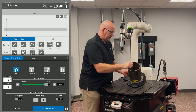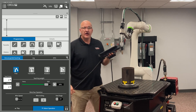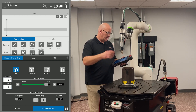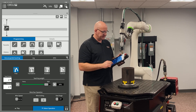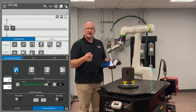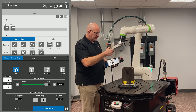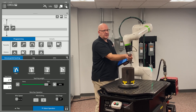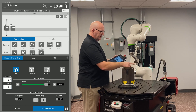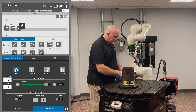I'm going to position the part with the weld start pointed toward the robot — the six o'clock position. I've created a program called 'circle,' and I have my robot operation tab up in free manual guide teaching mode. Before moving, I'll record a G point for home, then pull the dead man and force it out to put in an intermediate point so I don't hit the part. Now I'll get the arm with J6 nice and straight, set my 45-degree torch angle, and record a J move.